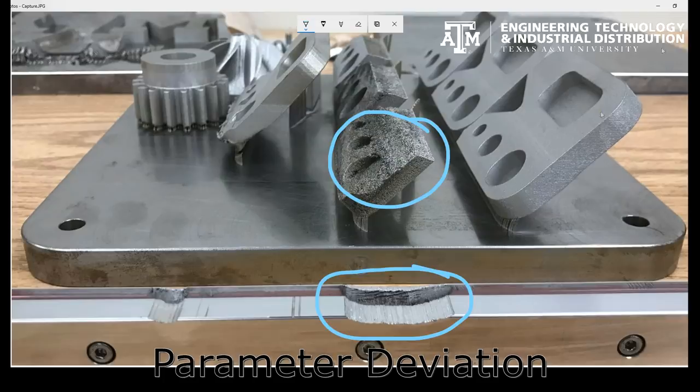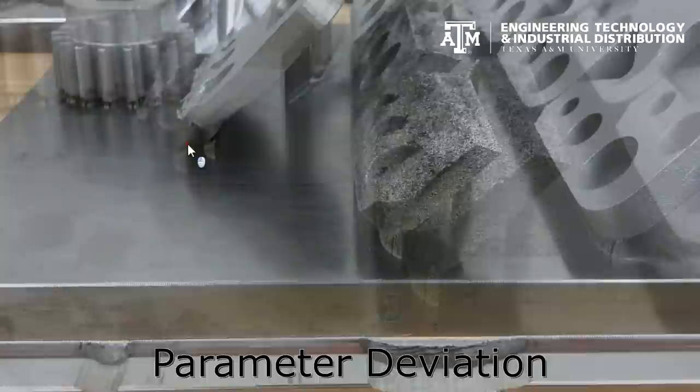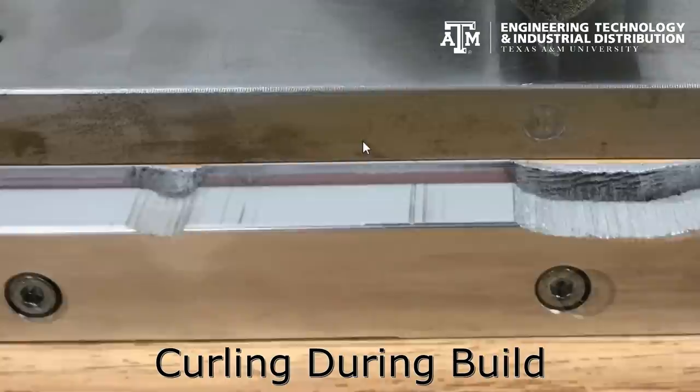A large mass equals a large amount of heat in the case of SLM. If your part has a large mass and not a lot of supports, regardless of overhangs, it will rip off of the supports when the build reaches the timing of heavy heat input. At this time, the section of the part that is already built can curl upwards and can crash the machine or slowly file away the wiper without setting off any alarm.